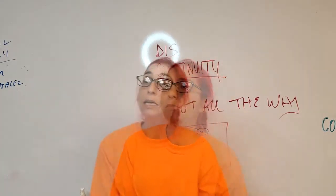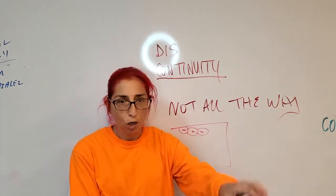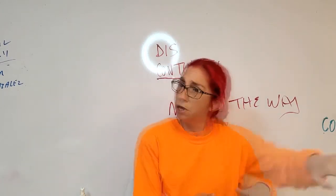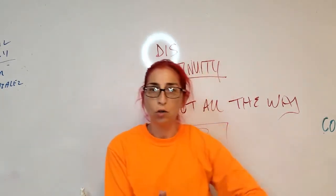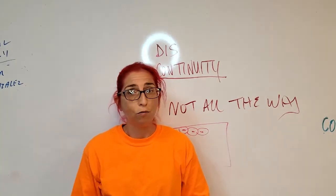The other thing would be cleaning. If I need to clean the slag off of my weld, I need to make sure that I'm removing it all, especially if I have a weld that's too convex. Because then it slips right into that little edge, and then you try to weld over it, and essentially there's no fusion and there's no penetration, okay? So you need to be very, very careful of that.